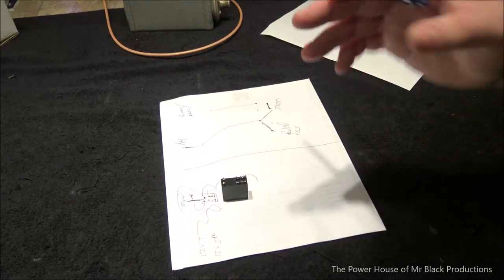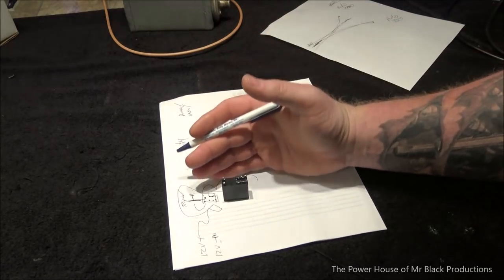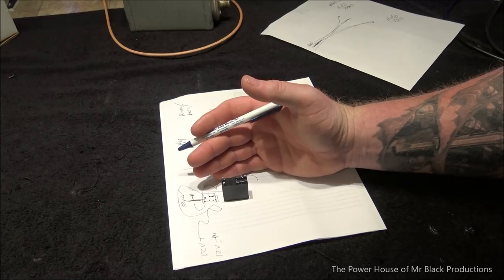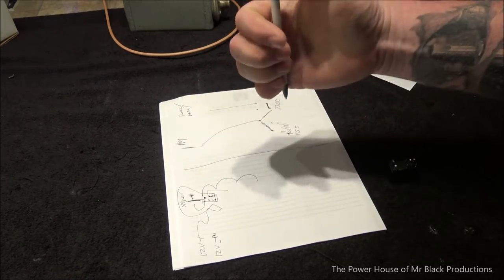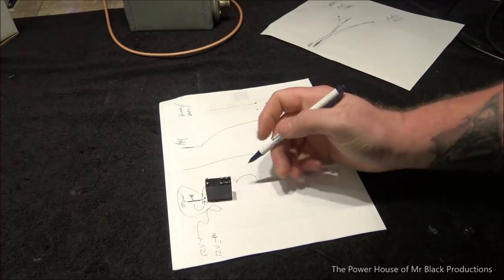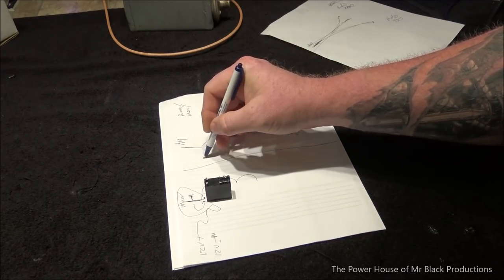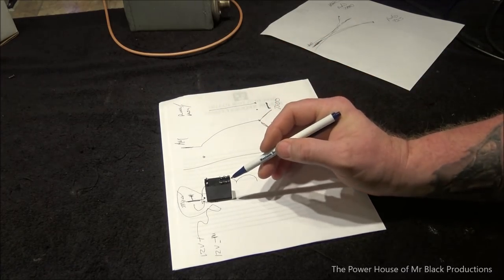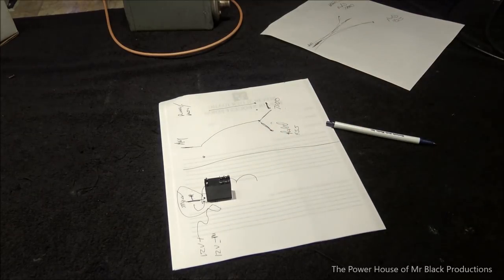So we're doing like a dual Dow-Key system. Not just RF, but we're also doing the radios and how we're going to flop them into transmit. When we go into transmit, we're going to take one of the legs off this relay, this lead, and run it over, and use it to start the sequence of events on this side of the cabinet. This leg here is going to hop out and fire another relay. Let me grab a couple more relays here.